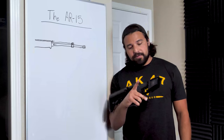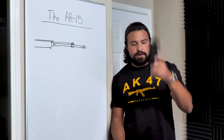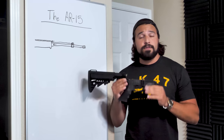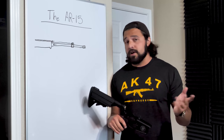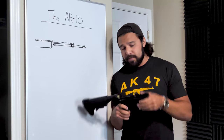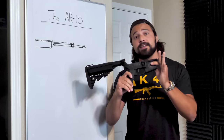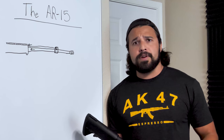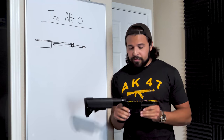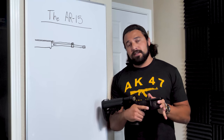I think we're done with the upper and we're ready to move on to the lower. This little aluminum boy is the lower — and this right here is an 80% lower. That piece is what is technically known as the firearm according to the ATF. So legally you can buy an upper from a gun store with no background check, because you're not buying a firearm. But as soon as you buy this lower, because it houses the fire control group and the buffer tube assembly, this is technically the gun. You buy this at a gun store, you're going to have to do a background check. Or you can mill yourself one in your garage — freedom. This houses the fire control group, the selector, the pistol grip, and the magazine well with magazine release and bolt release.